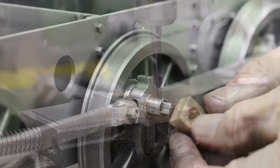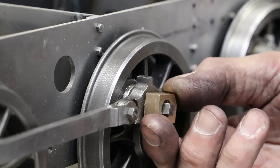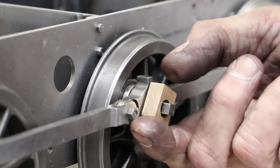As I do a test fit, we can see one of the other consequences of me moving that cylinder centre line out by 1mm, which unfortunately means I'm going to need to re-make the drive and wheel crank pins, but we'll come back to those later.